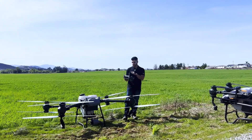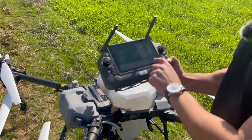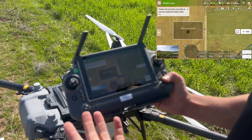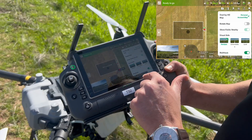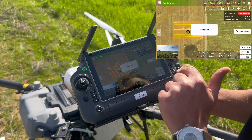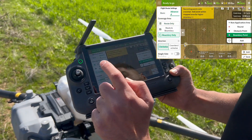Let's start checking on the remote controller. First, we go to Begin. You can create an automatic field — go here and make sure the multitask is enabled, then select your field, go to Edit, go to Advanced Settings, then Boundary Only.